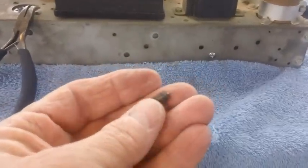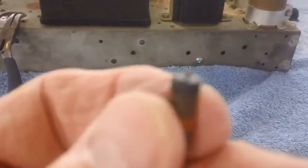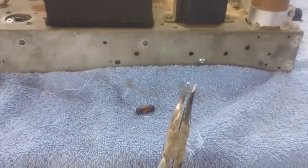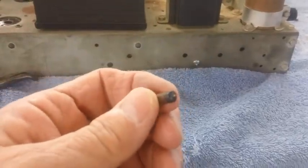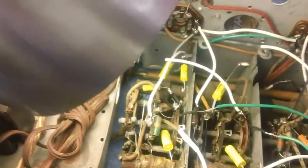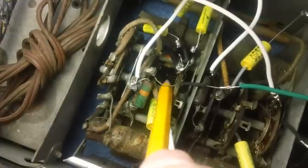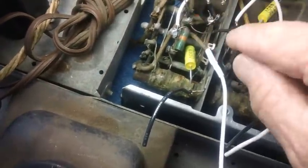We have success, ladies and gentlemen — it worked exactly like I said it would. These cutters cut it almost all the way through, and all I had to do was grab it with a pair of needle-nose, go left and right, and boom — it cut right off. Fantastic. It left a pretty nice little pigtail down there. Now what we're going to do is just take our alcohol and brush, clean it up, and stick this brand new 10K resistor on there just like we did with the capacitors, and solder it up right here.